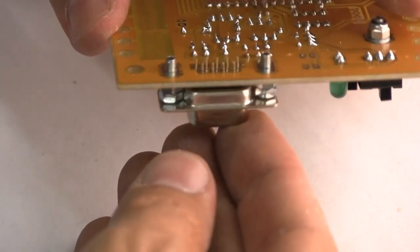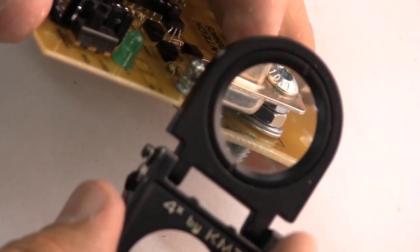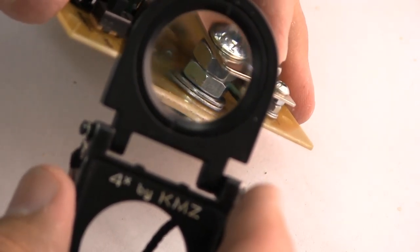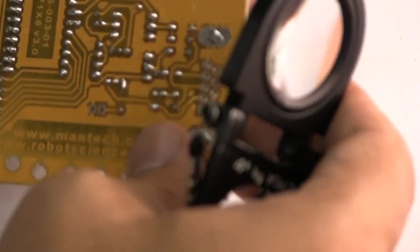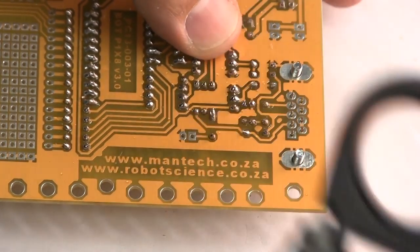Now you feed it in nice and straight, and you will notice that this part is now correctly spaced. Can you see now that's correctly spaced? So it's the little bolt, the two nuts, the two washers. And then you must put nylock nuts. Nylock nut, that's a little nut with a little nylon insert to stop it from coming unstuck.